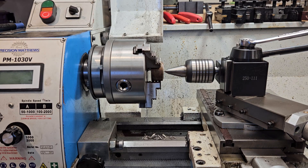Hey guys, just wanted to do another quick video. I wanted to show you how I eyeball center on the tool post carriage drilling operation. I set the height pretty much the same way - I actually did originally dial it in with a dial test indicator to get the height and the side to side, but honestly every time I do this I find that's not really necessary to be absolutely flawlessly perfect.